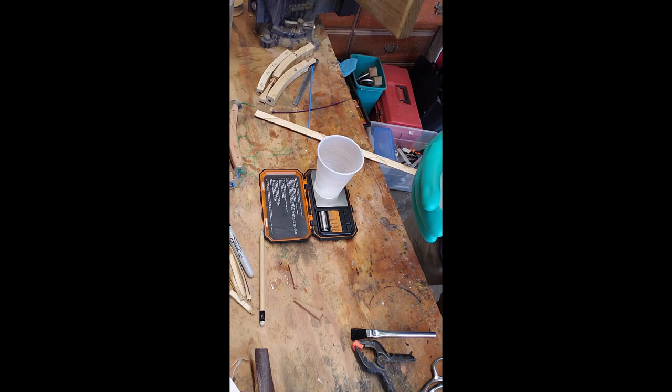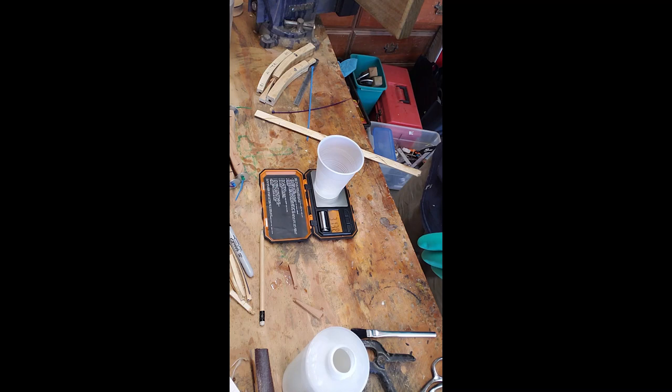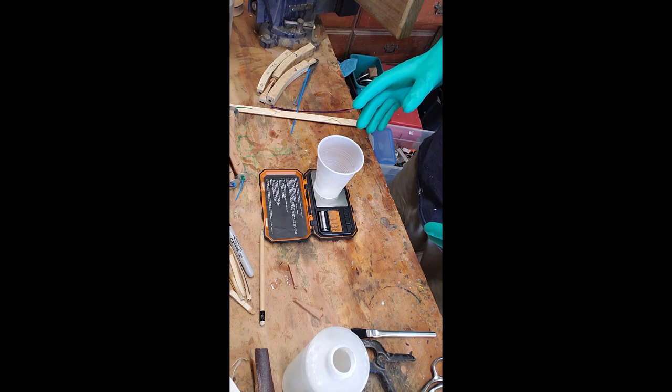I've already cut the carbon tow, and I have it in. So to wrap up an end like one of these with 12K carbon, you need about maybe a meter of 12K carbon tow. So I've already cut that, and then, kind of importantly, I've put all my carbon away, because when your hands are wet with epoxy, if you pick up your carbon or you pick up, you know, a sock or something, you've ruined it. You've got epoxy on it, and it's never gonna work correctly again.